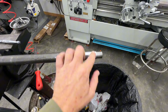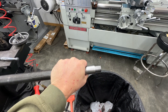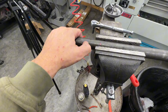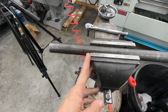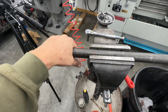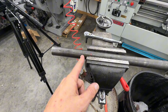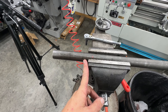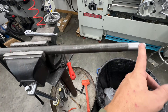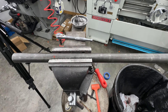Now I've got it out of the lathe. This is already cut to the diameter of its finish — I think Tikka's at 1.125 OD here. Now we've got to cut it off to its length. He wanted the same length as the original .22-250 barrel, so we're going to saw that off and then contour it. He said contour it however I think's best. I love straight contoured barrels, so we're going to contour it at the muzzle at 0.725, starting the contour straight — it's going to go down nice and straight and look awesome.